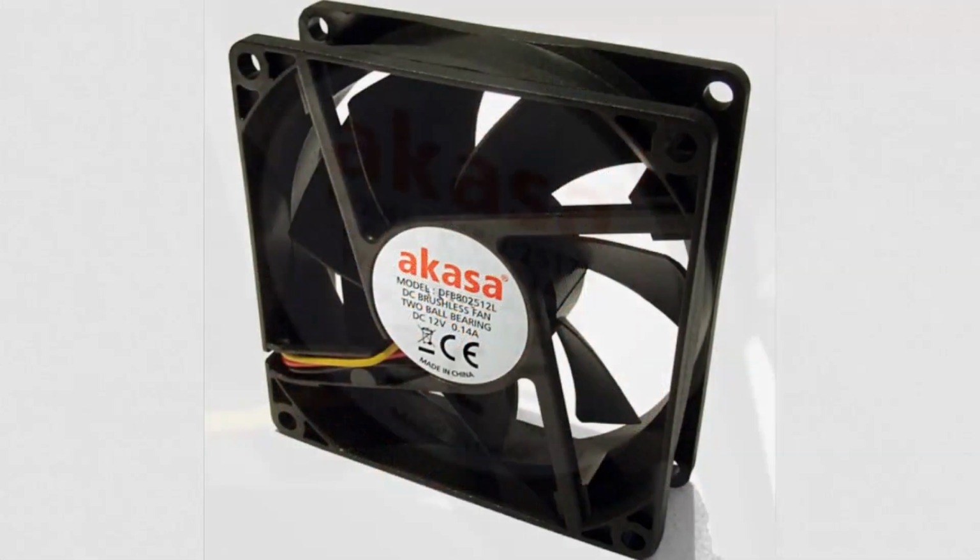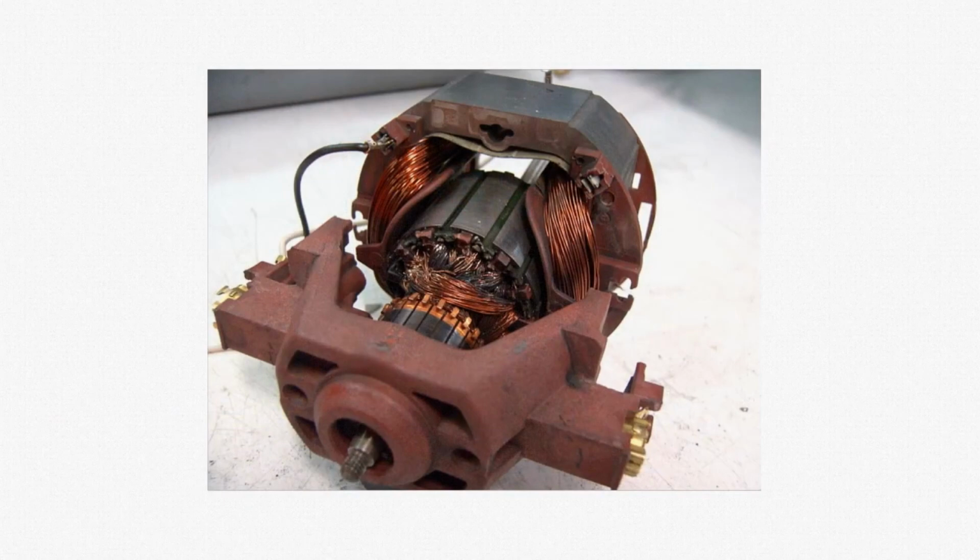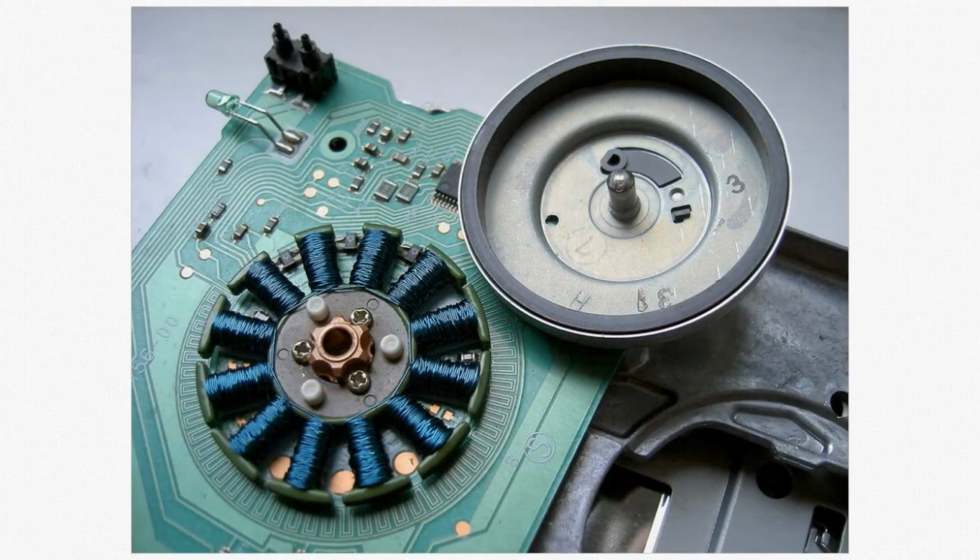And now, talking about DC motors in general, you might get the question, what about brushless DC motors? So these motors use brushes to make contacts with the commutator. What about brushless DC motors? Well, those are beyond where we are in the course right now, mainly because brushless DC motors aren't really DC motors at all. They are run by DC, but that DC goes to electronics that actually control the motor.